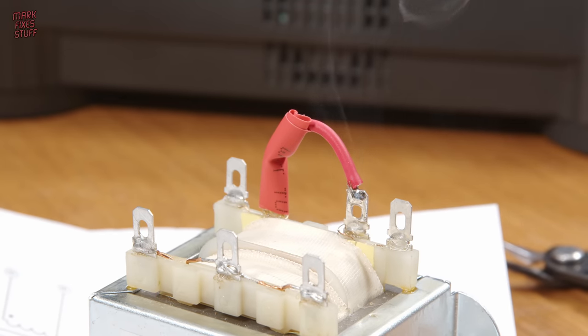The job wouldn't be complete without a bit of that lovely heat shrink insulation on them as well. Cables are extended and they're ready to solder to our transformer. This time I'm pre-loading the lugs with solder and then tacking the wires into the molten alloy — it's a different technique from before, but a bit easier. I should have gone with the next size up in the shrink tubing, really; this sheath is feeling a little bit tight.